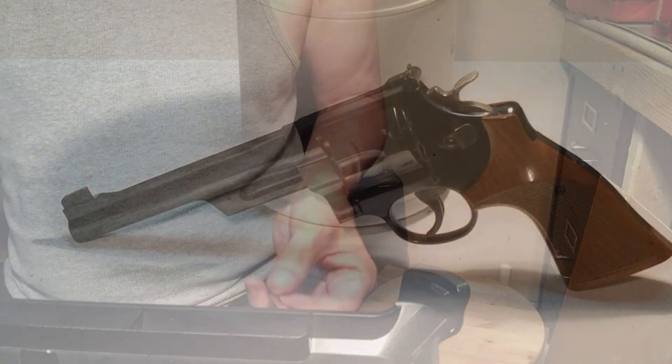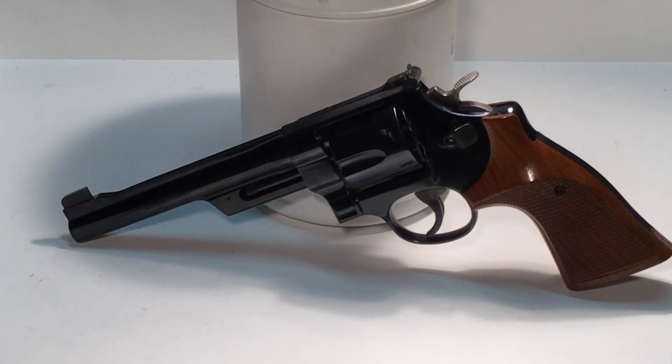That gives us a groove diameter of 0.350. So we've dispelled the myth once again that a .357 Magnum revolver has a barrel groove diameter of .357 — it just isn't so. The groove diameter is smaller than the caliber; in this case it's 0.350. If you want bullets one thousandth bigger than the groove diameter, you'd need 0.351-inch bullets, and you won't find any — not in handgun bullets — and no bullet molds for handguns will drop bullets at 0.351.